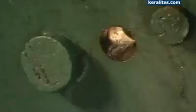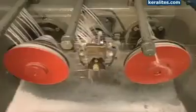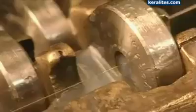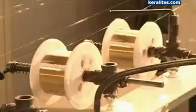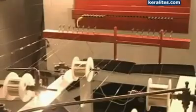Then what's now a wire is uncoiled and continues to stretch as it's passed through a die lined with industrial diamonds. To prevent overheating, the machine sprays lubricant to cool the wire while reducing it to the width of a human hair, its final size. The wire then winds into a spool, almost 3 kilometers long. Next, 32 of the spools are unwound, and the wires are run through another oven, which softens them further.